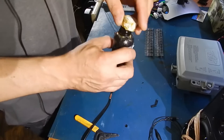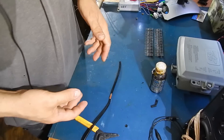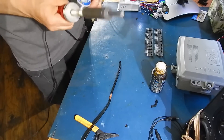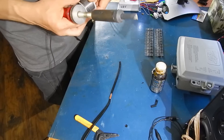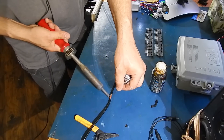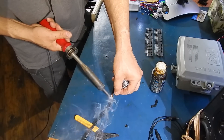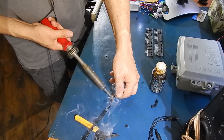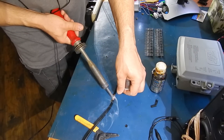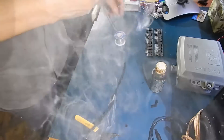So you've used the flux — I recommend flux because it will take less heat to fix it, to heat it up. Then you just take some solder and your gun and hit it with that. Do it outside, because working with thicker wires is pretty smoky. And that's why you use flux and put it together this way.